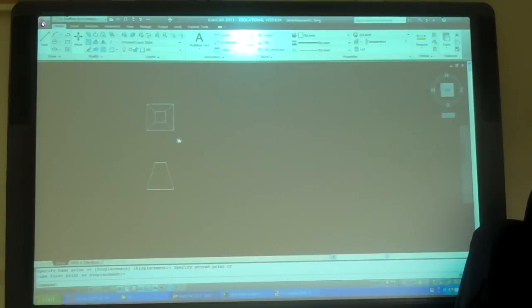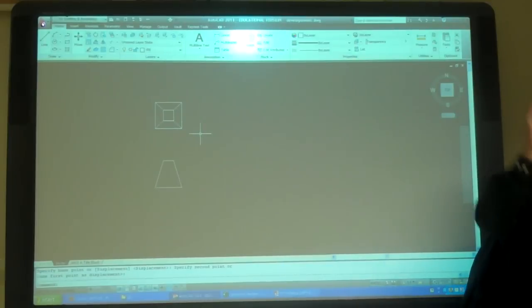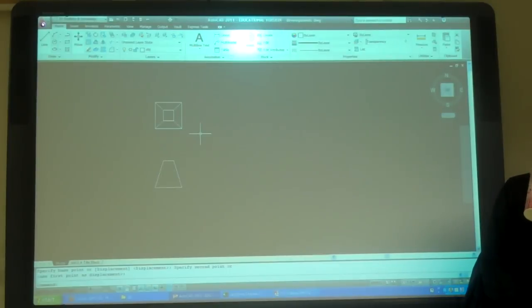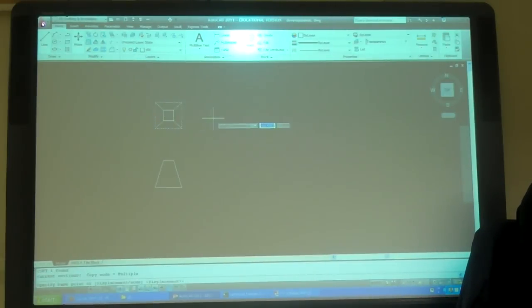So now we're going to move over and do radial line development. Now we know how to do a cylinder or something with straight vertical edges, but if it's tapered, we have to use radial line. So here I have a four-sided pyramid. How am I going to figure that out? Copy your side view over and then. Do I have any true length views? Or true size? The bottom, right? That's the only thing I have true size, right? So I can do that.